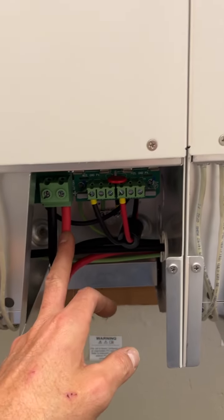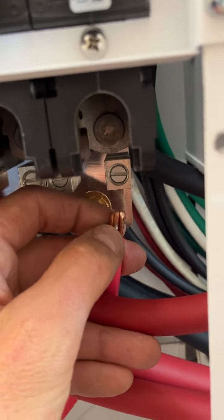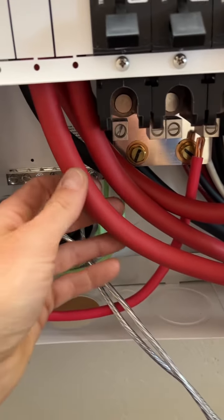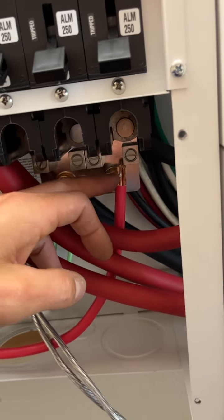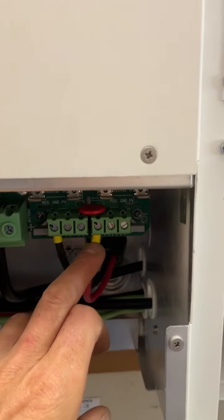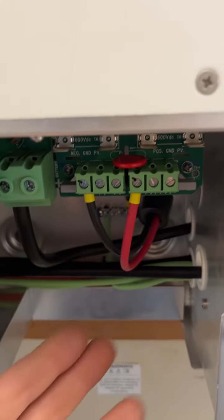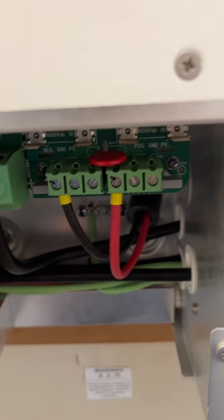And these are 7-strand cable, so it's exceedingly thick cable, if you can see that. When you bite into that, it just bites in really firm and you get a nice transfer. This stuff is running hundreds of thousands of strands. These guys have a couple hundred strands in it. So thus you get the flexibility, but you can't directly clamp on the wire itself. With these, you've got to put a ferrule on so that you're not crushing and cutting your wires. Because when you crimp them up to 45 inch-pounds, you can literally cut the little strands of wire. It's permitted, but this is always a winner. You crimp it on, and then you put your crimp down on a metal tab on the ferrule.